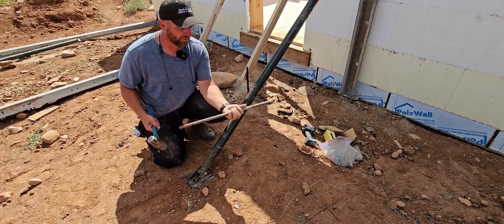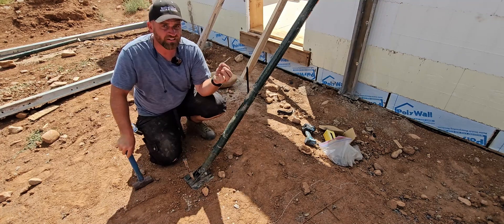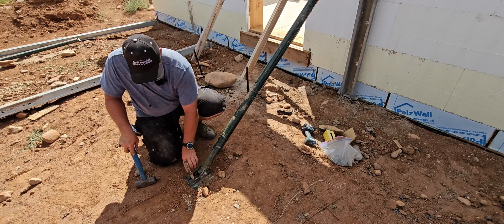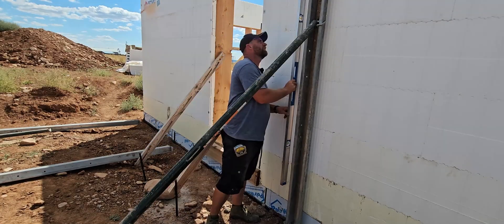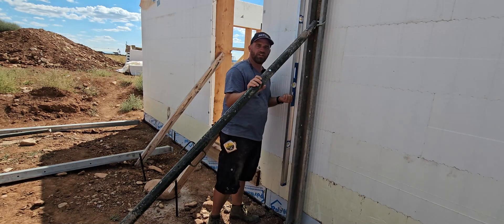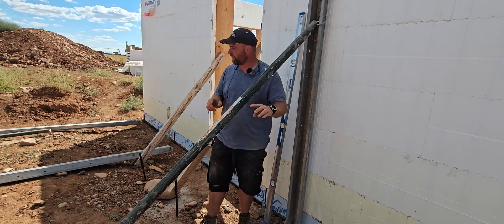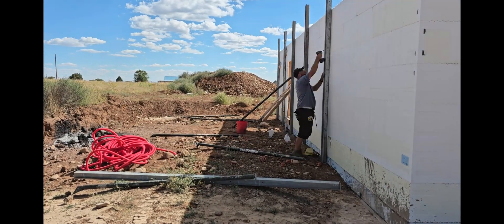I don't know how plumb that wall is, so I'd like quite a bit of adjustment in either direction to begin with. This is one of the leftover concrete stakes and a framing nail — I put it in one of the holes to anchor this down to the ground so the foot doesn't come up. Next step is to take my long level and put it against the wall. This wall is pretty level already — if it had to go in I'd turn it this way, if it had to come out I'd turn it this way. I'll put all of them on this wall then come back and level the whole thing from one end to the other.